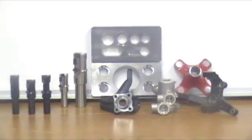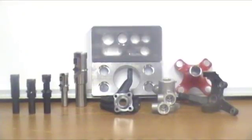Second is our drill mill chamfer cutter. It adds the capability to top chamfer a hole or contour shape. The third is our drill mill double chamfer cutter. It adds the capability to interpolate a back chamfer on the hole it produces.